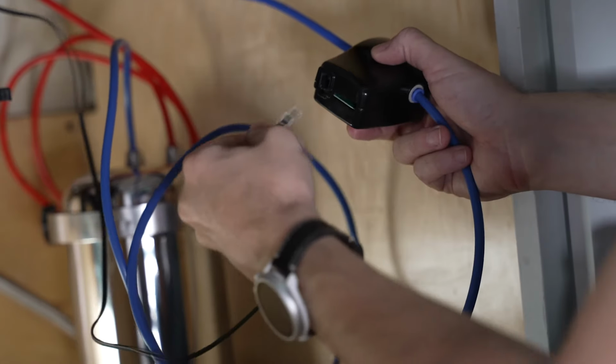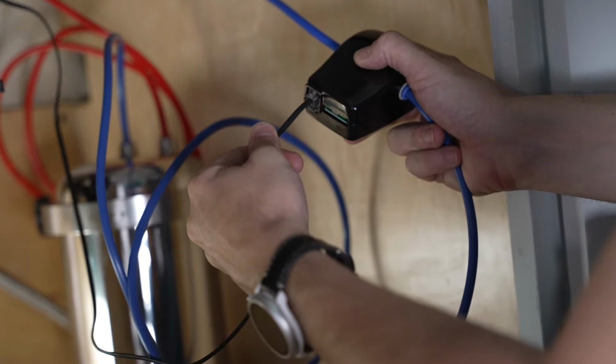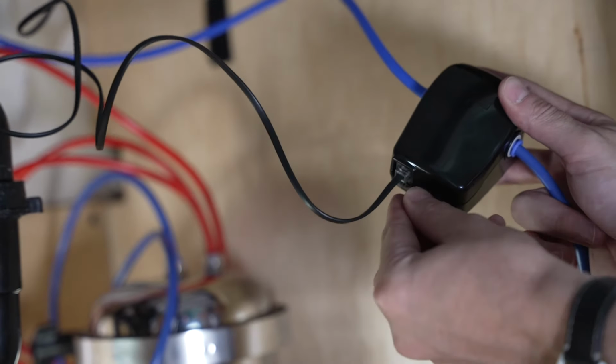Insert the cable connector into the cable port located on the intelligent monitor. Then insert the battery shuttle into the battery port located on the monitor. The LED indicators located on the system faucet will flash green, yellow, and red 5 times. This sets the rated capacity counter to 0 gallons. Be sure not to remove the battery shuttle until it is time to replace the filter cartridge. Doing so may result in loss of data.